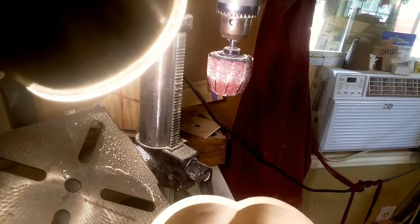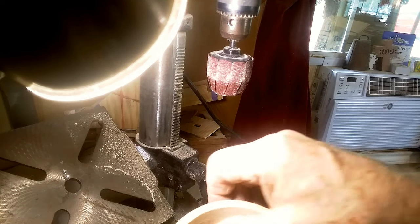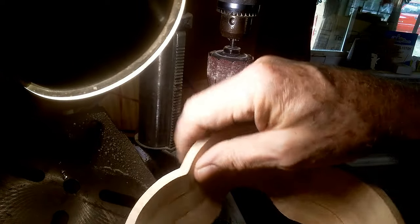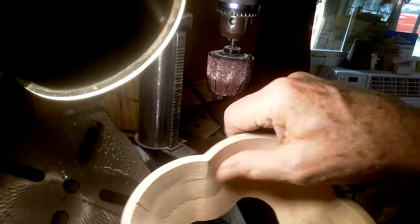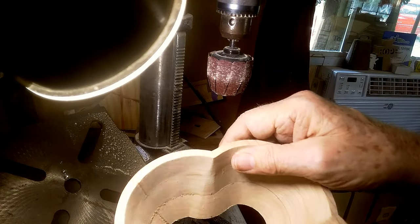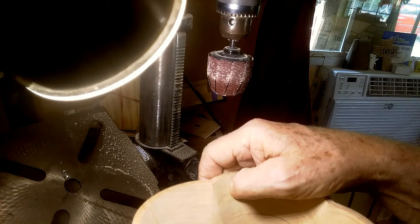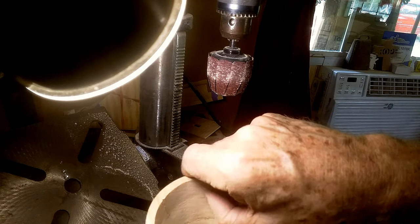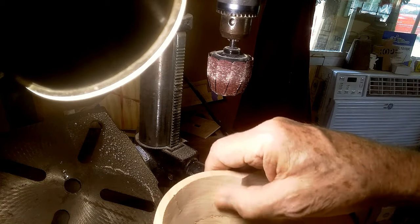When I'm sanding these, my first consideration is to match up the rings, and I go down each joint and get it clear and clean. And you see, I can see a spot right there. Shine that little light across it, you can see spots you don't see otherwise. Got to get a little shadow off of it and feel it with your fingernail. If there's a spot, I've got to sand a little more.